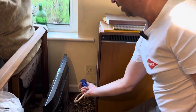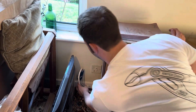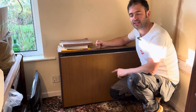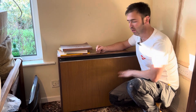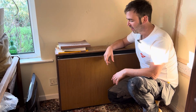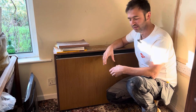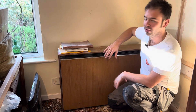The storage heaters are very old, and on purpose I installed 20-amp blue Click Flow plugs. I didn't want to go into these heaters because it's highly likely they contain asbestos. So I cut off the flexes to each of them and installed the 20-amp Click Flow plugs so that the client can remove them and dispose of them safely, or when they get new ones they can wire them in directly. I didn't want to touch them.